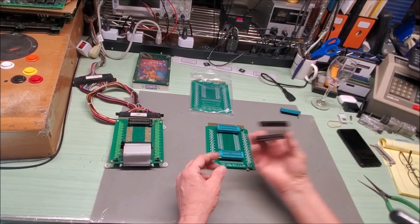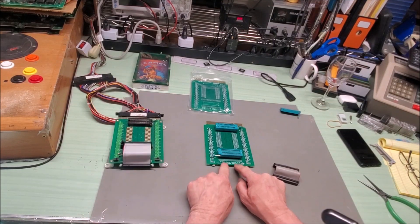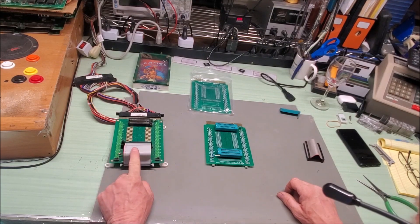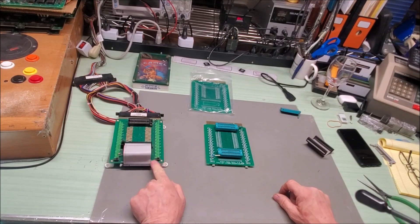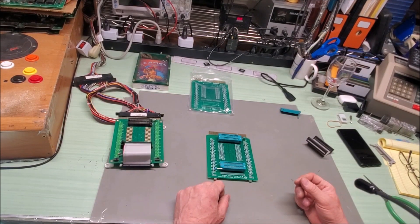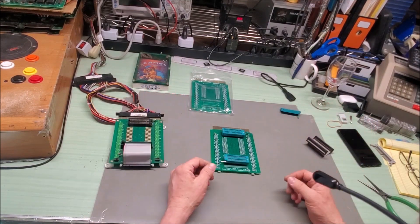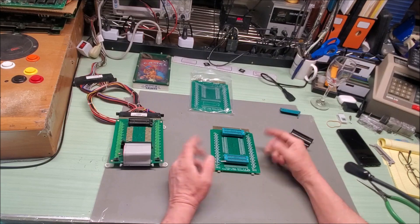You can't do real short cables — these are too short, you can't put them in. Originally I was going to put two of these headers in, one on each side, and then you'd be able to test the shorter ones. In fact, I might still do that. Most of the cables we were testing are for Galaga and other games, but I guess I need to be able to test these short ones too. So maybe I'll put one connector on each side, which is how we originally designed it. You get to test half of the pins at one time, and if one of them is out, you've got a problem with your crimp. And if one of them is on on the opposite side, then you know you've got a short.